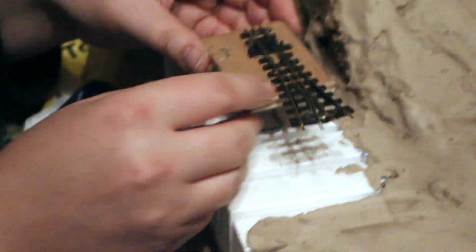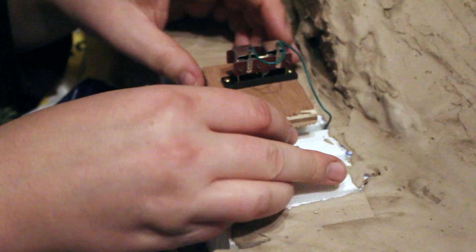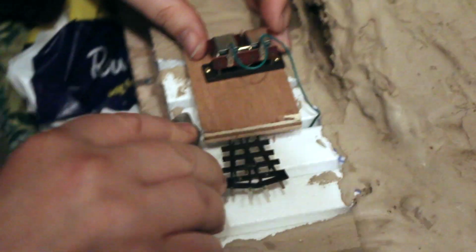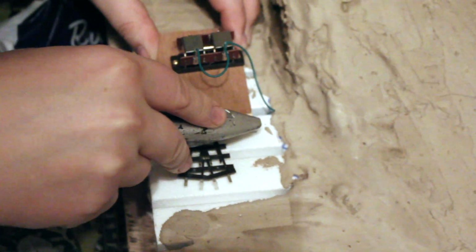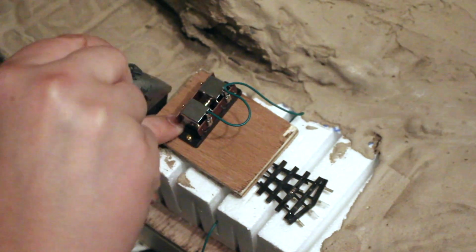First things first, what I want to do is to get the cutout so this can sit down into the risers, and this is a bit tricky. There's a lot of kind of trial and error. So what I'm going to do is actually I'll turn that upside down so that we can kind of work out the rough size of the piece of wood, because that's all that we're trimming out for, and there's no sense making this hole much bigger than we absolutely need to. So at this stage, that's all we need.